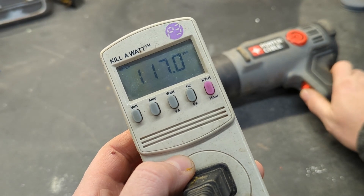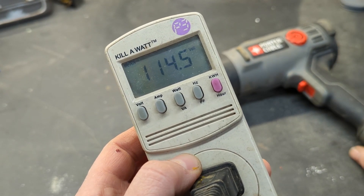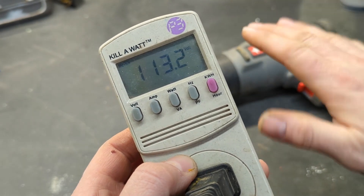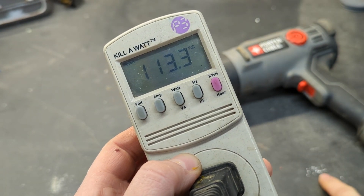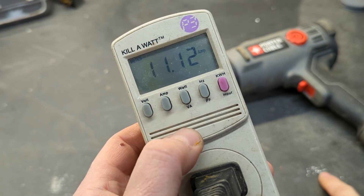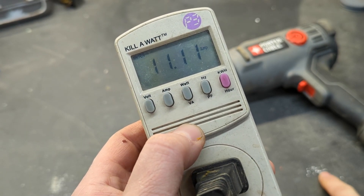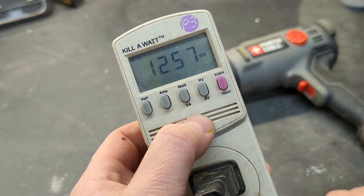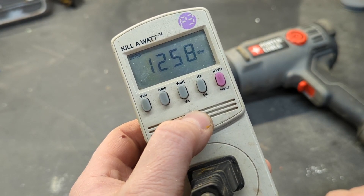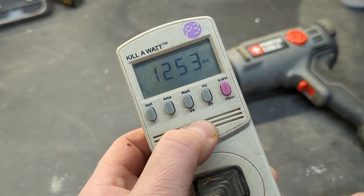There's a little voltage drop. Let's turn it on high and we have a larger voltage drop. We're still okay, but this device is probably pulling too much amperage for the extension cord. If I go over to the amp rating, it's pulling 11.0 to 11.1 amps — that's quite a bit. And if we click on watts, you can see it's pulling 1,252 watts, which is a lot.